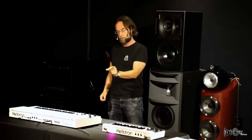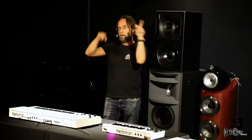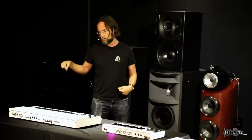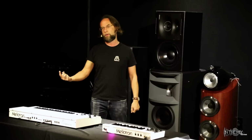But the mechanism to spool the whole thing was a bit more intricate. The principle was like a reel-to-reel, but it was just 35 of them next to each other. So you'd press a button and the tapes were rolled up on rolls in the front and the back. When you press the button, there was a motor and a chain connecting these two rolls, basically. The whole mechanism would stop scrolling, and then there was a little extra tape that hopefully kept track of where you were, and it would stop hopefully at the right point.